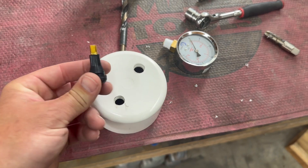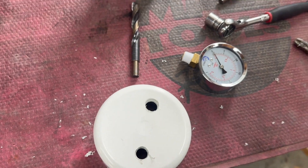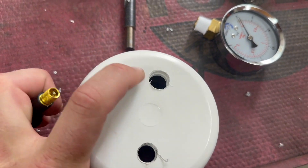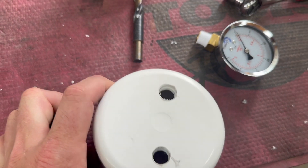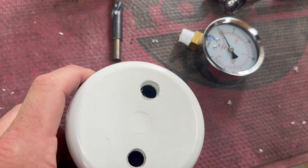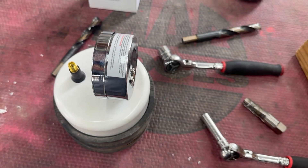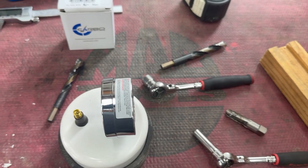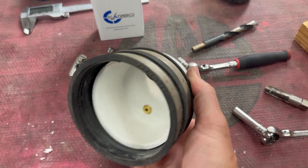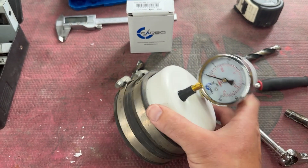One thing to note — the Schedule 40 is pretty thick and there is a seat basically for the valve stem to pull through. If you try to pull it through at full thickness it's probably going to want to slide out on you. So I took a step bit and sank it down about halfway through before sticking the valve in, so it has something for that upper lip to catch on and keep it from falling back out. Once you put pressure to it it's going to push it out of the fitting, but just for good measure, if you don't have a step bit, grab one. And there we have it — the little trick with that step bit worked out perfectly, snapped into place easily. You can get a valve stem kit with tools for about ten bucks. A pair of pliers works too, just to pull it through. This is pretty simple — a couple of minutes — and you'll probably end up saving about 50 bucks on this project.